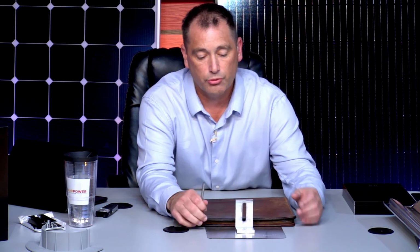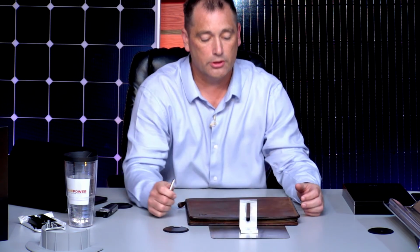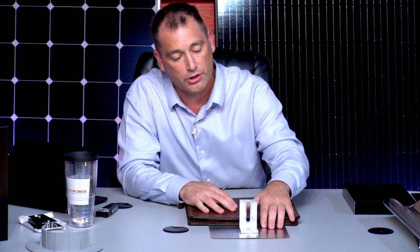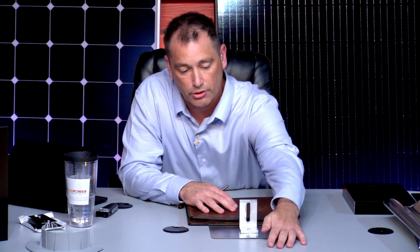So what they do is they'll put a little bit of sealant underneath, because there is going to be a hole that goes in the roof, but this flashing, you can see the hole underneath, but the flashing is going to go underneath the shingle above. So what happens when it rains, that's the concern we're having, right? We want to keep the water out of the penetration. The water comes off this shingle, hits this flashing, and goes right over to the next shingle and continues to go down the roof. So it literally makes it to where there's no leaks at all.